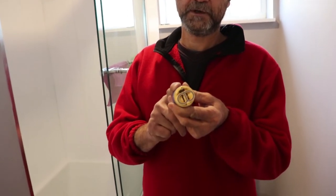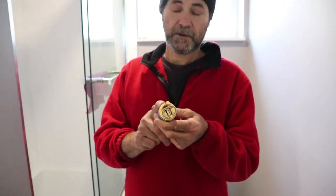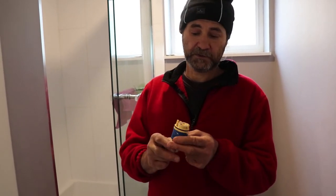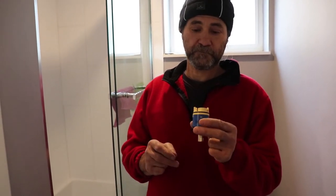The first solution for this one — I got a new gasket from another washroom we have with the same faucet that's not being used. Because this place is rented, we just have to solve this problem right away, and then I'll have more time to deal with the other one. Probably I would just go pick up the same faucet and replace the element, just use it for parts — not the whole thing, because replacing the whole thing involves removing tile and all that work, so it doesn't pay to do that. I'll still try to find the gasket too.